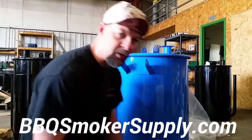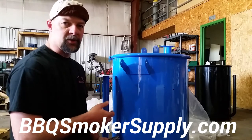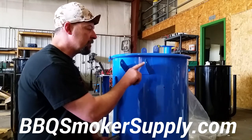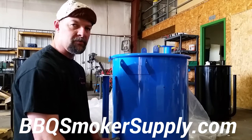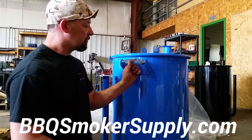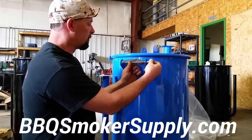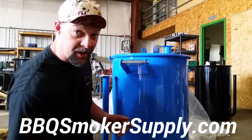In order to assemble this, it's going to be a little bit trickier since this is already on the side of the drum. We powder coated this — powder coat's a little thicker. So I took a drill and I cleaned out the powder coat. You just take a half inch drill bit and just kind of clean out the hole a little bit. It's not that hard. Then the first step is you line this handle up in there, and then you take this shaft — it's already been beveled or coped so that it's easy to get in the hole. You just slide it in there like that, and once it gets to this other side it may hang up just a bit.